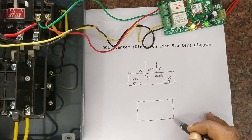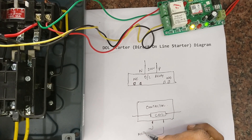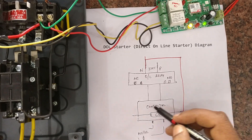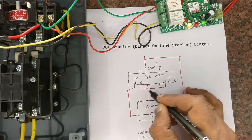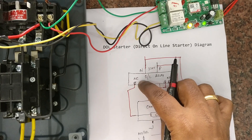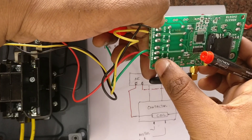The lower portion is the actual contactor; it has a 220 volt coil, and the output connects to the motor. The neutral of the input is connected to one end of the coil, and the other end of the coil goes to the NC contact of the red button. One end of the NC contact and one end of the NO contact are looped, and the phase is connected to the NO contact of the green button. These internal connections are already done inside the starter — you need not redo them. We will simulate start and stop using the GSM board relays.